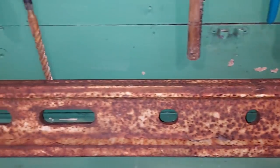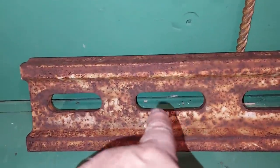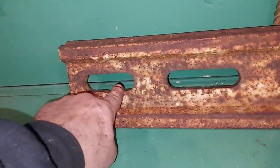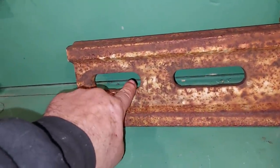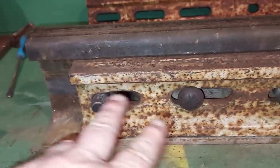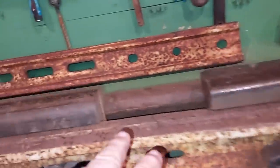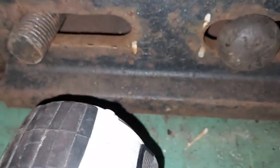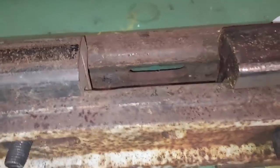These slotted joint bars are for a pretty wild pull apart, a rail head break, or you can make a temporary repair with them. I had these milled — oh, maybe 15 or 17 years ago I took a set of joint bars down to a machine shop and they milled them out. Never cut a joint bar with a torch because it makes it brittle and it will crack — these are milled out. They come in sets. We've got slots on one side and three solid bolt holes on the opposite side — you can see the slots on this side and the three solid bolt holes on the other side.